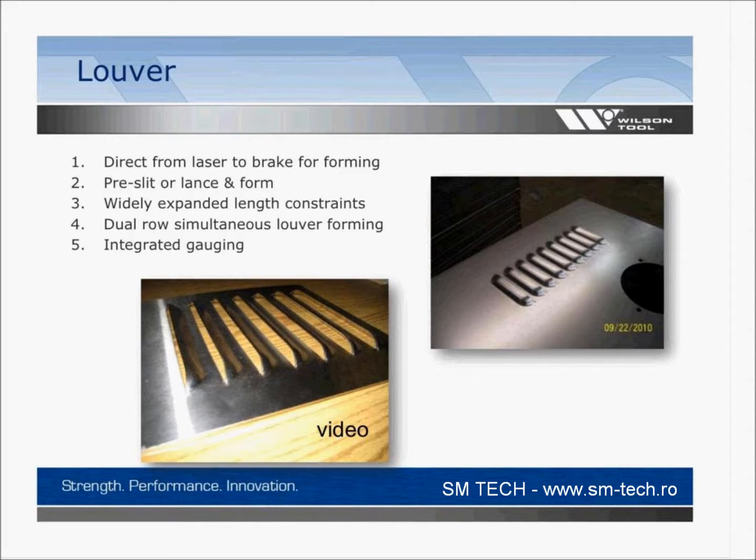But when you pierce this, you're going to want to check with your brake manufacturer because there aren't many out there that I'm aware of that account for the snap through in their press brake. It gets transferred into the hydraulics, even if we use spring pressure to try to absorb some of it. That snap through that goes into your hydraulics, if you did it once or twice, it's not a big deal. But over time, if you do it repetitively, you could have problems. So you probably want to check that out.